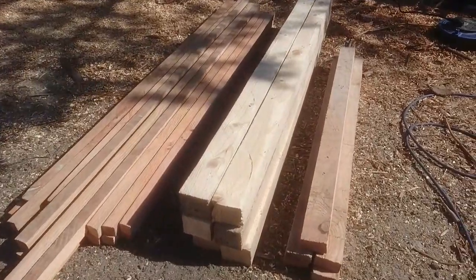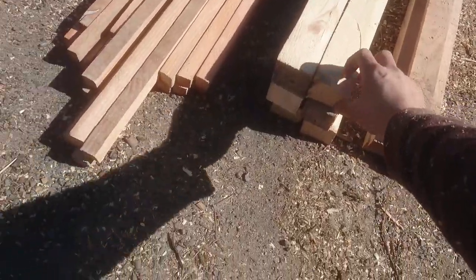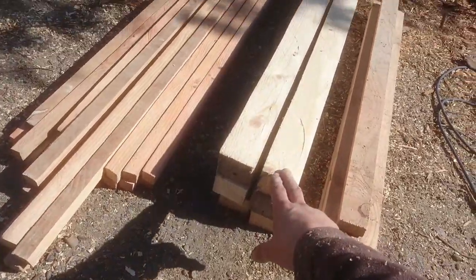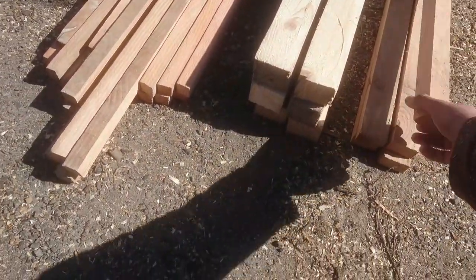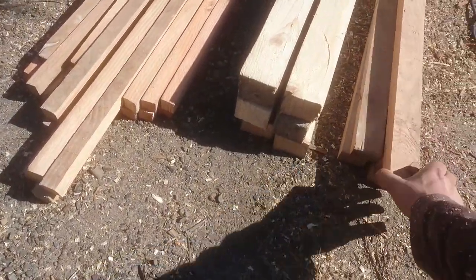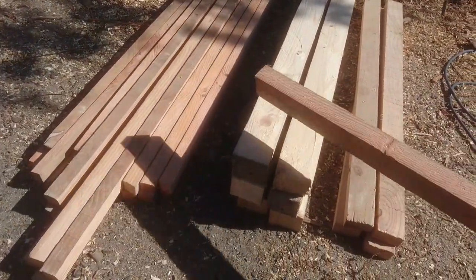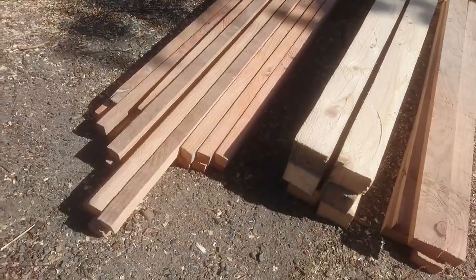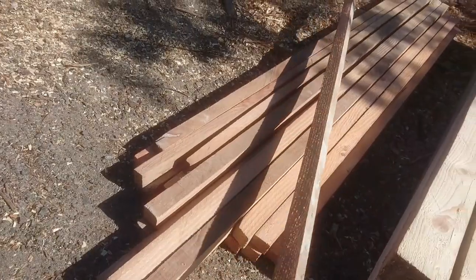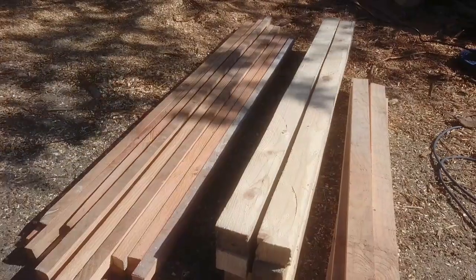Here's the pieces now cut to size. So this was the scaffold board that are now 2 inch by just over 2 inch, but there's 6 of them which are going to be the uprights. Then you've got here, which again was an old boarding shed, all different sizes, but all I need is 1 foot distance for this now, which is going to be your cross members, your supports for the lats, which are just some 1x1s that I've cut now from old floorboards, I'm guessing. Well, they were the old floorboards. But yeah, time to assemble.